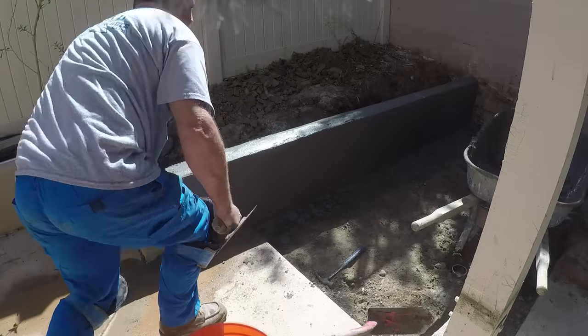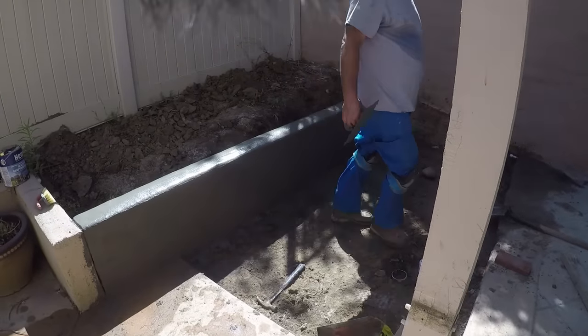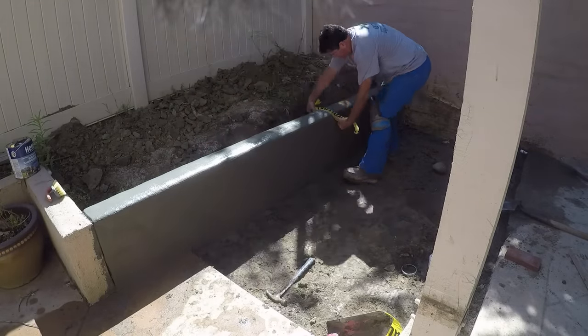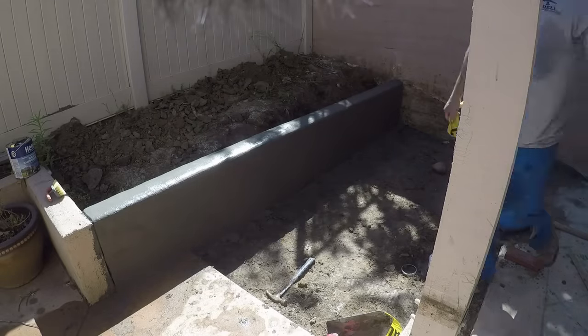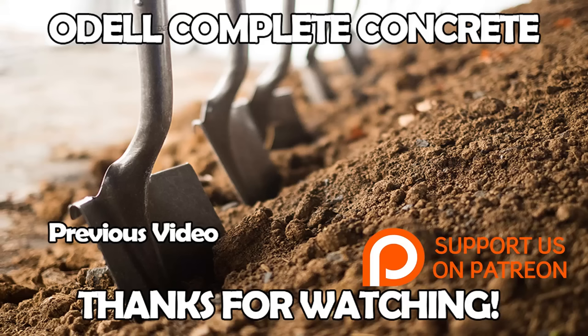I just got done putting some Type S mortar on here — I trowel it on and keep it all about the same thickness, then let it dry a little bit. We have a little crown on the top of this wall that I had to match, so I built it up first using concrete mix with rocks in it to give it a little height in the center, then put the mortar on top of that. If you go mortar the whole distance it's going to crack up on you, so you have to go rock then mortar. That's how it looks when you're all said and done. Thanks for watching — have a nice day, don't forget to subscribe, comment, and like.